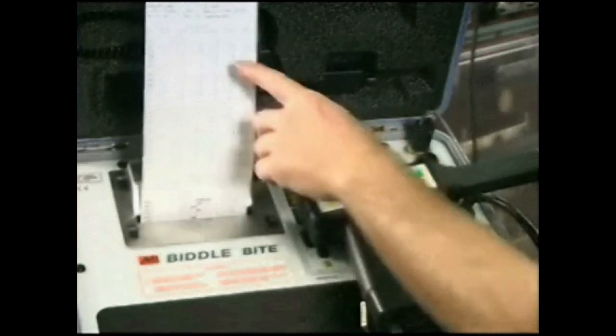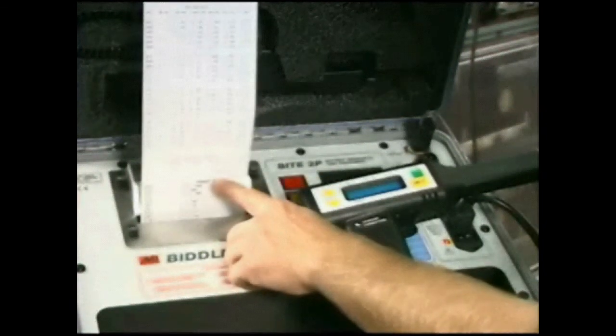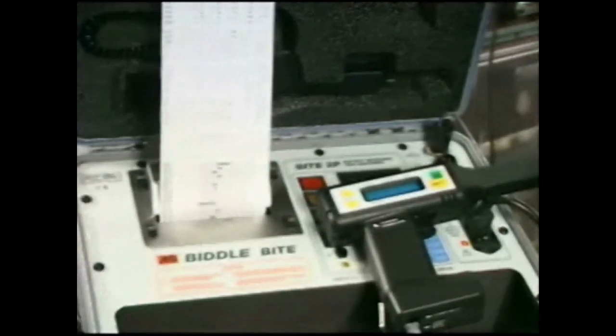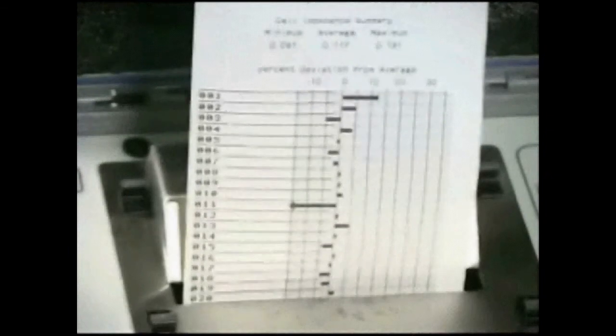You can see the bar graph coming out now. Cell number one is about twelve percent above the string average, which is calculated here. And cell number eleven is more than fifteen percent below the string average. Since it's a thermal printer, it's printing lots of information so it does move kind of slowly. At the end it will show all the cells. This is important from a data interpretation standpoint — you can see how each cell fared compared to the entire string, as well as compared to the baseline value entered by the user, depending upon the cell model and type.